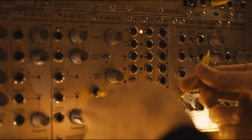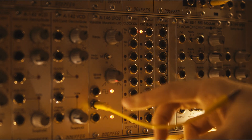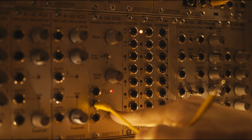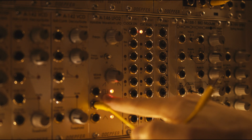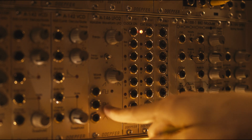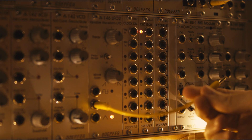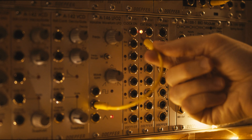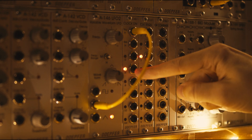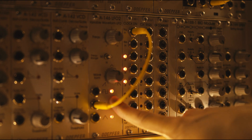So let's connect that now. We're taking the pulses coming out — let's do it unipolar rather than bipolar. It doesn't make any difference if it goes beneath zero; we care about zero or above, which is what this one outputs. So we'll take the output of that and put it into the trigger end of the clock divider. And you can see now it's starting to count up in binary, in sync with each clock pulse from the LFO.